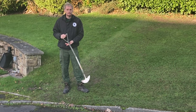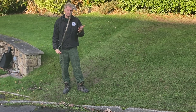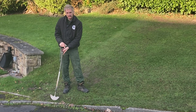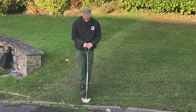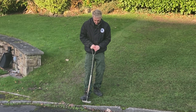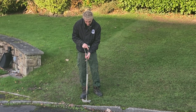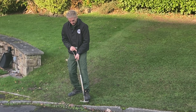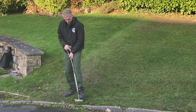We're going to need two tools today: a shovel, but first a half-moon or edging tool. What we're looking to do is find the back edge of this curb. What you're looking for is to hear a bit of a crunch off the curb. I know I've got in too far there but I'm actually spot on. So what I can do now is just work back this way, listening for a crunch - the metal just touching the back of the curb.